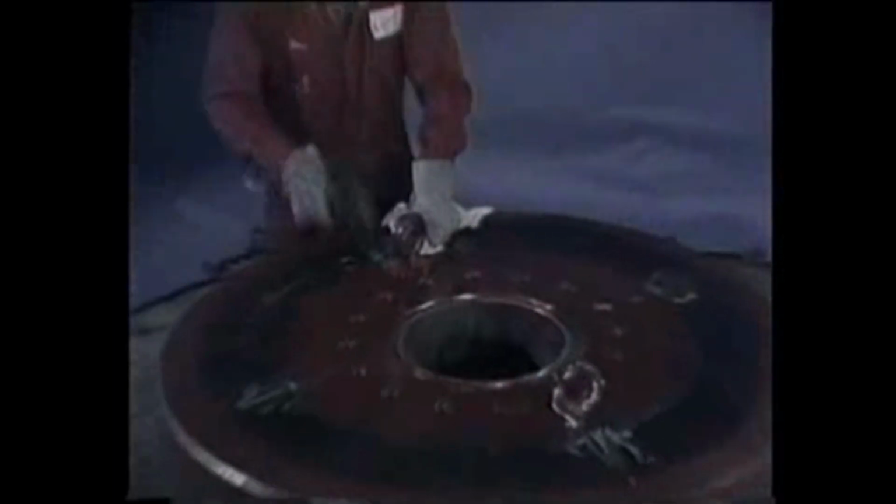Pack the cavity around the head of each actuator screw with clean grease. Then close the access flaps. Use a rubber mallet to ensure a tight closure. At the same time, hammer around the ID and the OD of the trash seal to make certain it's sealed against the top and the body.